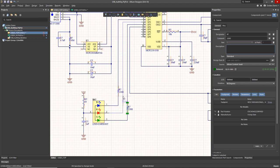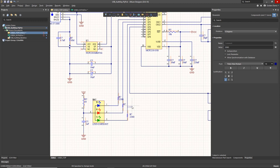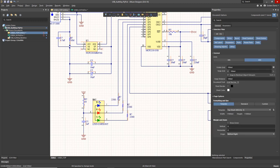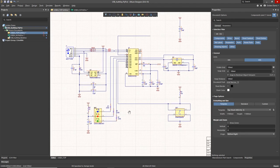You'll see also that when you drag and move things in the schematic, the schematic validation is always running. It shows you if you're going to modify the net list — it gives you a little warning sign or a green check mark if you're not making any electrical changes by the edit you're doing. That's really helpful. I'll just drag those around to tidy it up.